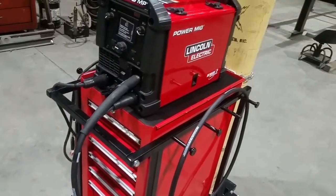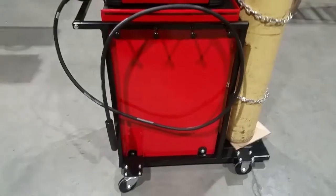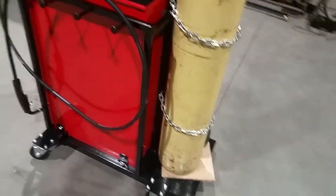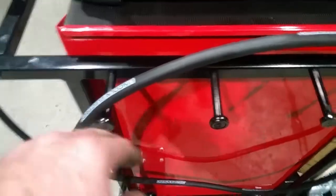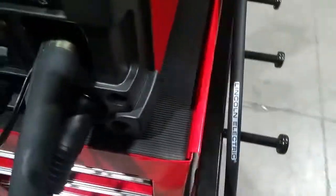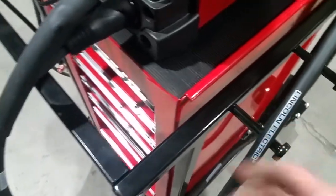I really liked it. I've looked at many many videos on YouTube about custom welding carts — some ideas were great and some, well, you know. This is where I work and where I fabbed up this welding cart. The base down there is thin wall tubing, one and a half by three. The rest of it is eighth inch one by one tubing, and what you see here are embedment concrete studs — for embedding steel plates into concrete. I drilled through both walls and plug-welded it on the back side, so that gives it a nice clean look with no visible welds.